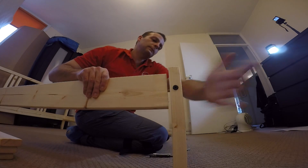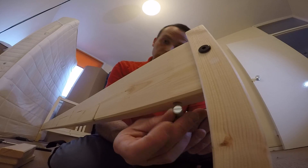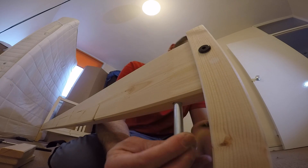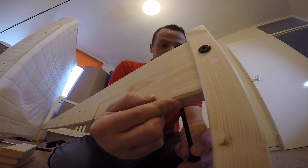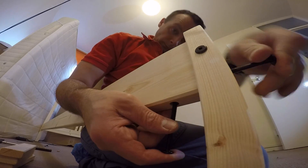Exactly the same on the bottom of the bed — join the legs with the middle panel. Long tube with two holes: watch out, the holes have to line up with the front holes, then put the long screw straight in through those two holes.